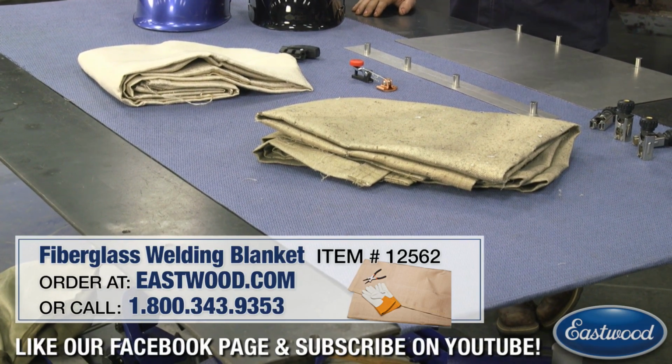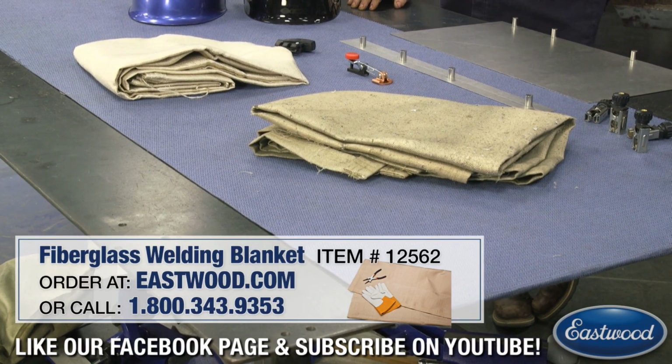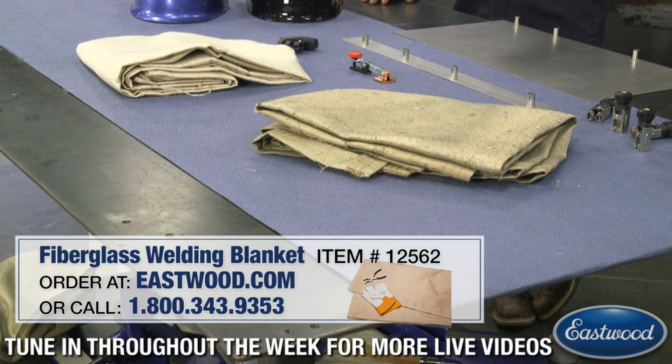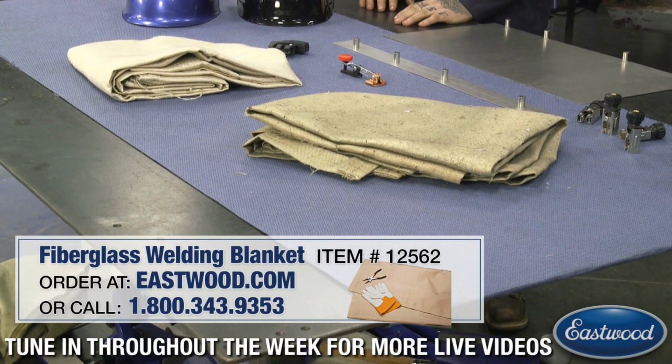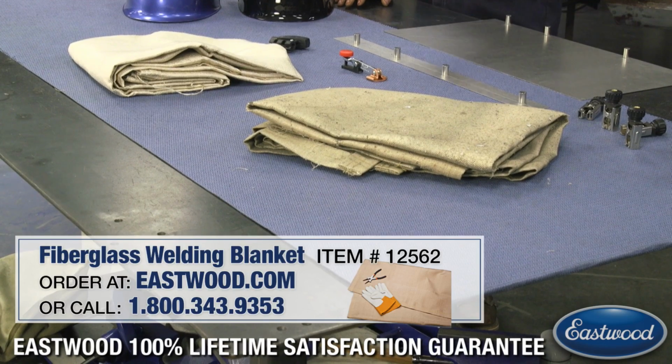This is good, especially where I use them a lot is if I'm doing floors on a car that still has a partial interior in it. You can throw these blankets in, cover up some of the interior, so that if you do get a stray MIG spark or grinding spark, it's not going to start your whole interior on fire. So you can put them over.